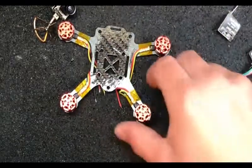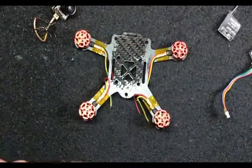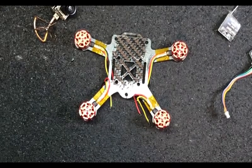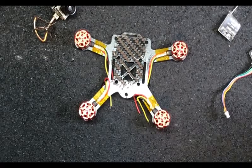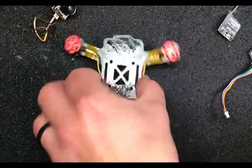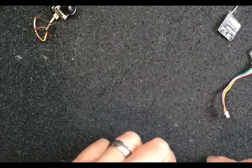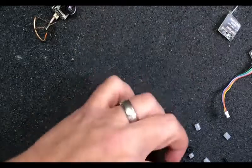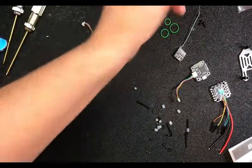Make sure you're in the fucking camera - they want to see this stupid shit we're doing. Now I'm going to mount the stack - get all components into place. He's got these little silicone dumpy ass looking things that came with the Racerstar ESC, but the thing I don't love about that plan is it's going to keep the stack pretty high. So I would just use the nuts - that way it's a lot shorter.